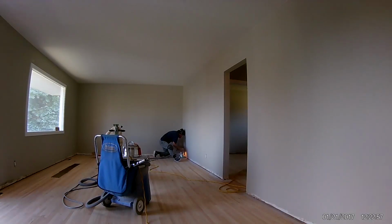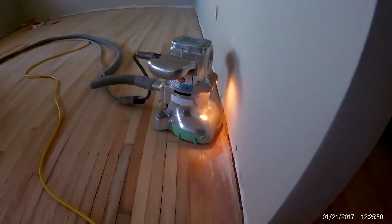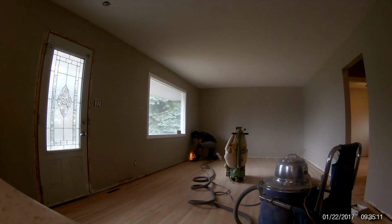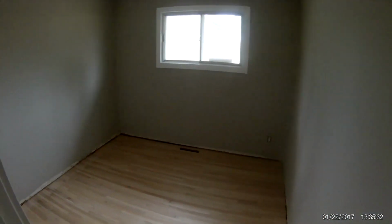Work the sander back and forth along the wall to blend in where the drum sander has stripped down to the original floor. Just go nice and slow and work it so you only have to go through once on the 40. This equipment can be rented at most equipment rental companies. I found that they usually have all the sandpaper as well. Look for a Bona supplier for all the stain and finishes. I really have had great success with their products and will always recommend them for all refinishing hardwood floor projects.